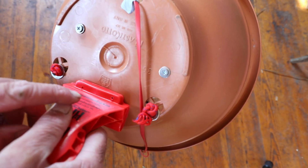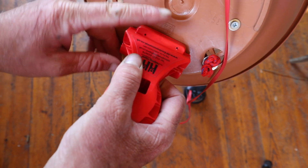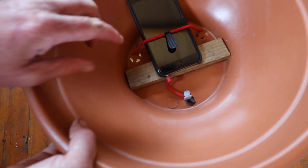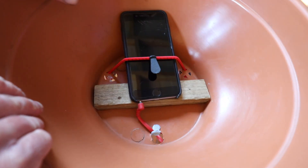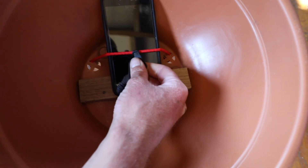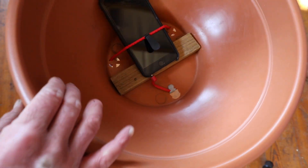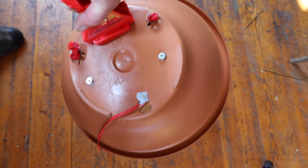I'll just walk through it from this angle as well. So I've got the handle here which is screwed in to the base of the plant pot from the other side. I've got the bungee secured via just a couple of knots with the washers here. I've screwed the piece of wood on the other side — this is where the phone is mounted on this side of the parabolic dish — and I have a piece of wood which just keeps the phone a little bit raised up from the base of the dish. This bungee cord secures the phone on the inside like so, and the headphone cable comes through this hole here. This piece of wood is screwed from the other side — pretty simple really.